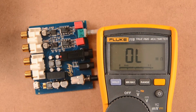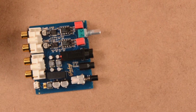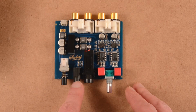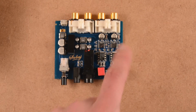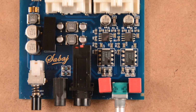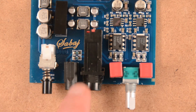Yeah, so just as I thought, the manufacturer simply added a series resistor for the 3.5mm jack. What this does is increase the total impedance as seen from the power amplifier, but then the circuit wasn't designed for that, and it just sounds garbage.